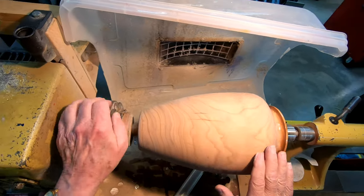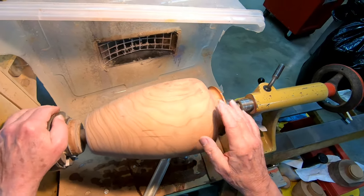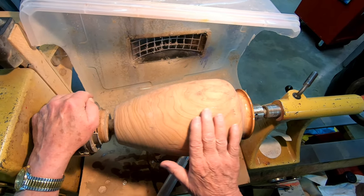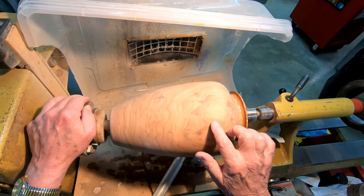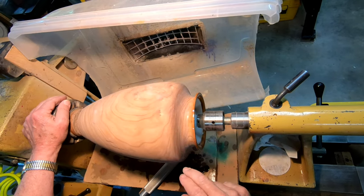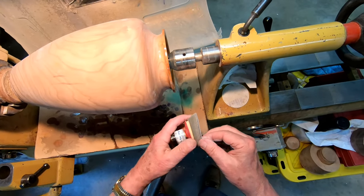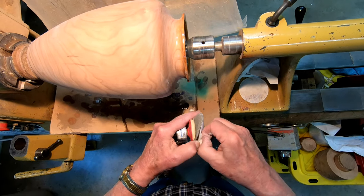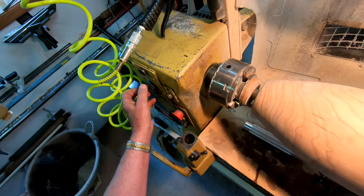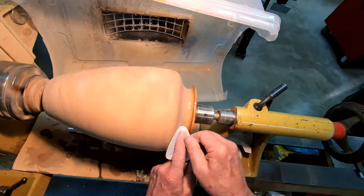It's really important when you sand this that you get all of the gloss off. Now, you can see the reflection in the light. You can see that down deep in where we had that open grain, we're not going to be able to get down that deep, but we've got the rest of this pretty well done. And right up in here, we couldn't get this with the inertial sander, so we're going to use that piece of 600 grit 260L. We're going to turn our dust collector back on, and we're going to get that.